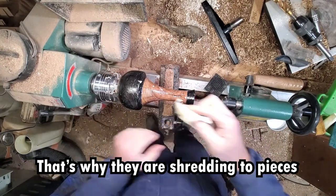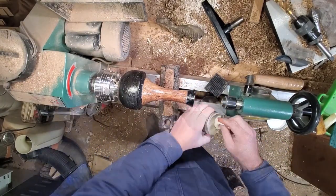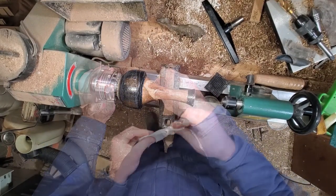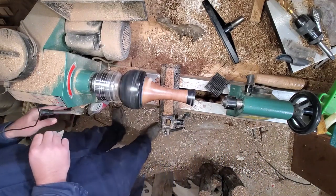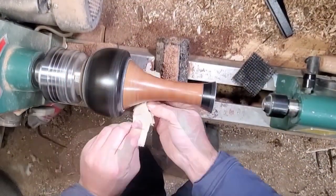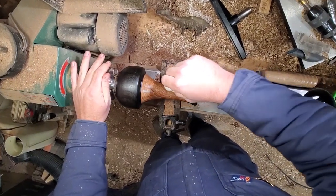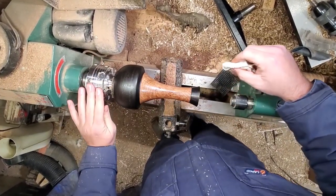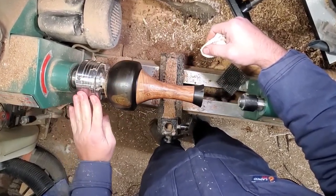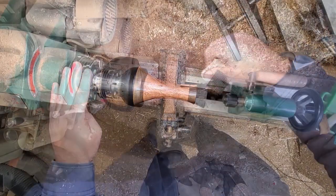The only difference is that my sanding paste isn't extra fine — it is not as coarse as some others sold on the market. I like to spread it out a lot because otherwise it's just gonna fling everywhere — stand back when you start it up. I have to get my toothbrush to get some of that grit out of there. Not bad — it didn't get rid of too much of the ebonizing, you can still see the grain through it. It didn't ebonize the sapwood as much as the heartwood — that's expected.